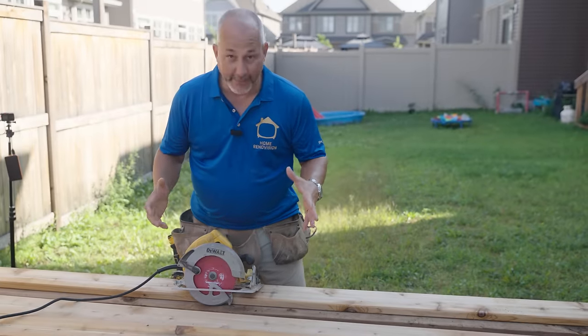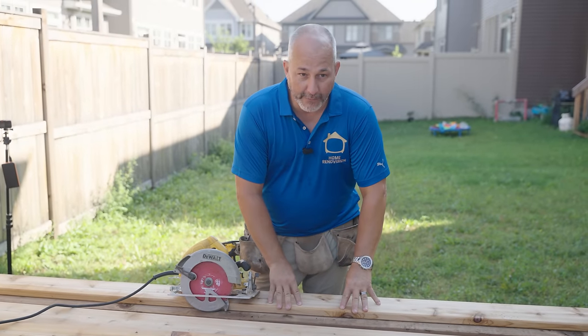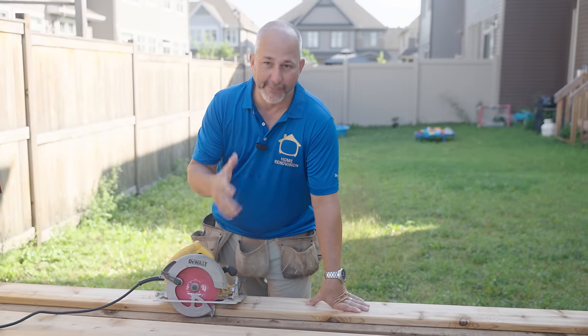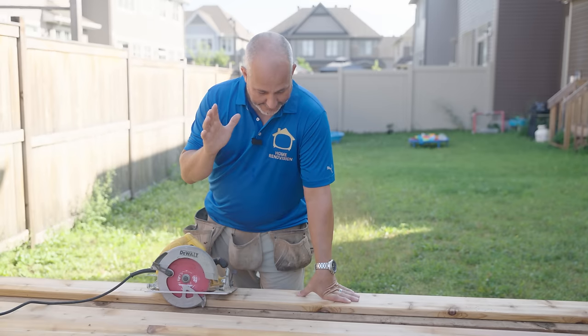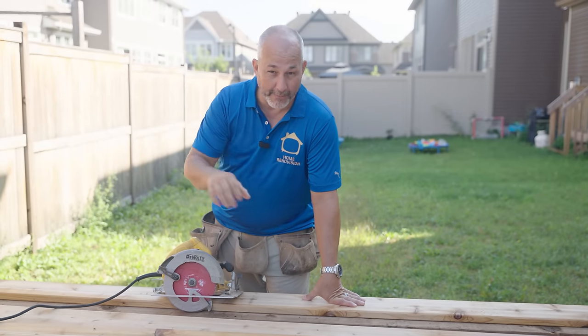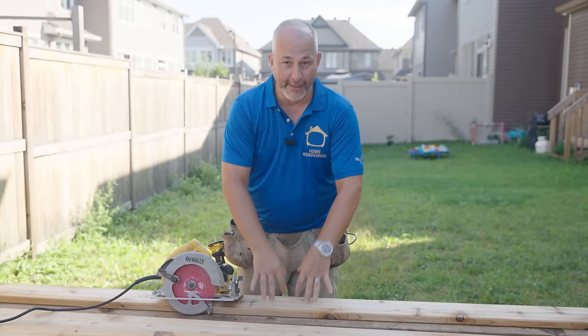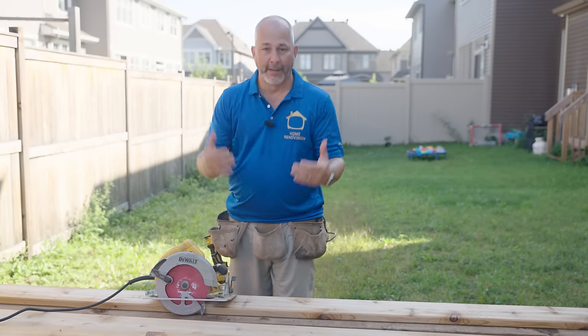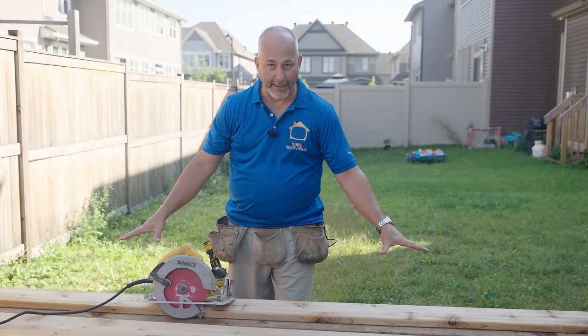I've got to close that all up. Basically what I'm using here is a couple of over 5/4 boards. Remember whenever you order a large amount of wood for a project like this, you're going to have a few that just really aren't desirable, and that's fine — usually they have a warp or a bend. Now it's time to cut them in half so we can use that wood as our support under the nosing, and then we can add lattice underneath after that.